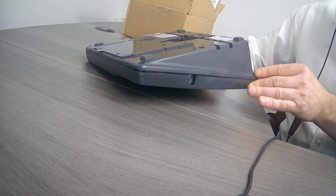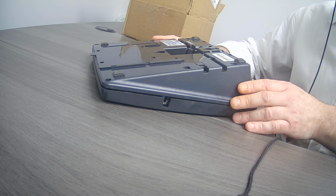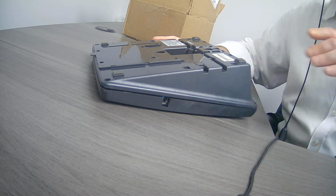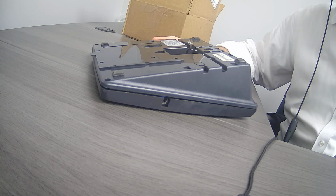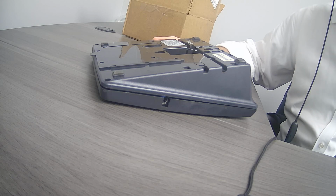connector. If your RJ9 female connector is broken and you're having an issue that your handset is not connecting to your phone, often it's not the handset, it's the connector itself, and this is how you can repair it. Included in the kit is the female RJ9 connector along with the B connectors, which is how you connect them together. It doesn't require any expertise, no technical know-how, just simply putting the right two wires in, which we have a guide for that'll come with the packet, and crimping it together. Now bear in mind this is only a temporary solution.